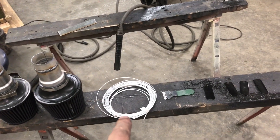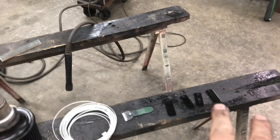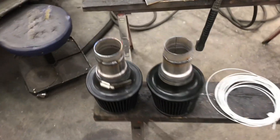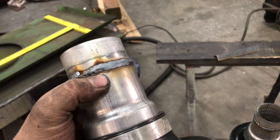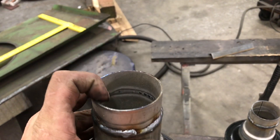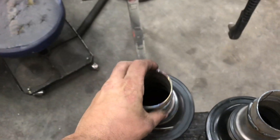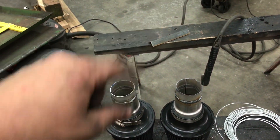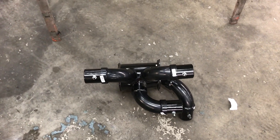I've got some more cable, so tomorrow I'll start with mounting the handle and getting those cables run. Today I built my tabs that will mount on the controls — the mixer valves up underneath the engine bay — those will be hooked up to the cable controls. Started working on the air filters. This is a 3-inch OD exhaust coupler to 2-½-inch OD, with a piece of 2-½-inch OD slipped inside — a tight fit on 2-inch PVC. I got two of those built because they'll go underneath the hood, one on the left and one on the right. The mixer box is starting to look like a spider had a meth experience and decided to build this very strange web.